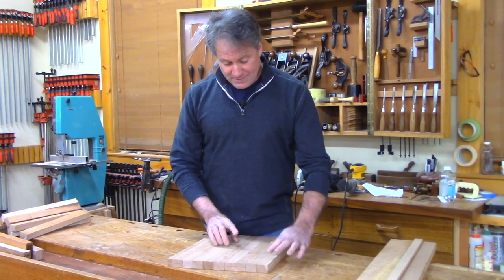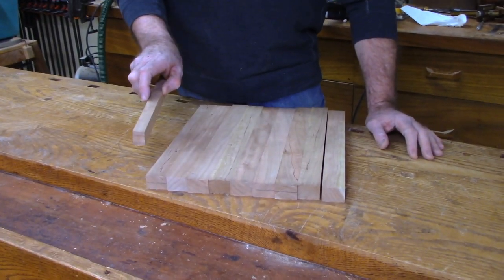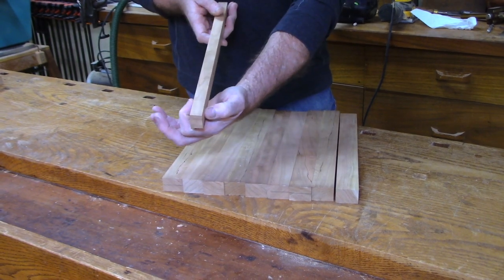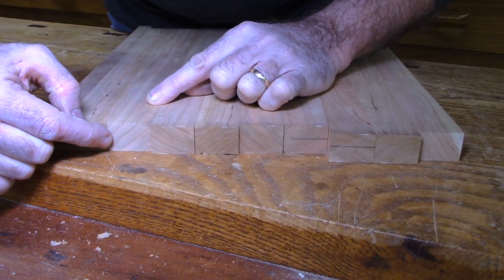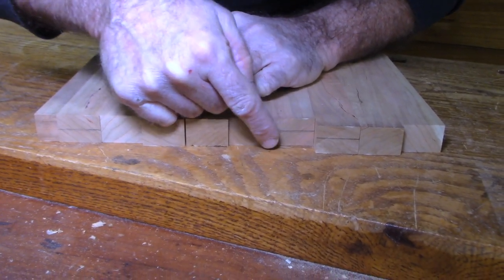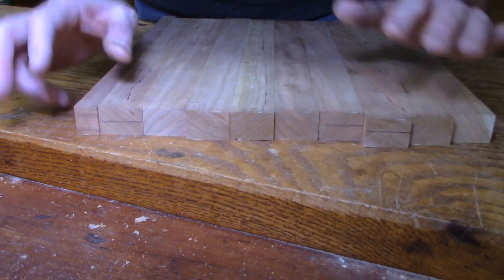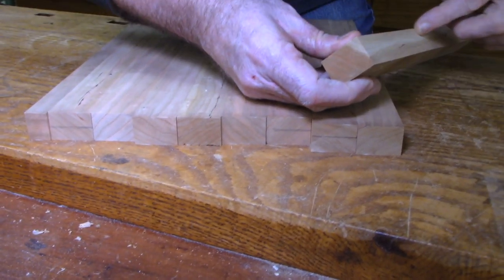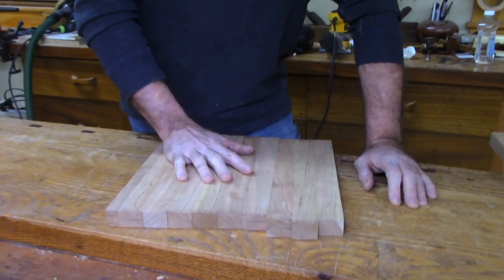You may notice here I've got one, two, three, four, five, six, seven, eight, nine, and a half. So one of these pieces I just ripped in half — roughly a three-quarter inch piece. I arranged them, but here's what I was looking at: if you look at the end grain here, you can see it's angling up, then angling down, up, down. I tried to reverse them. You might have some straight ones — you can just mix them in. You may have some sapwood in there too. I put this sapwood piece on the edge, and that may end up showing at the end of my board.